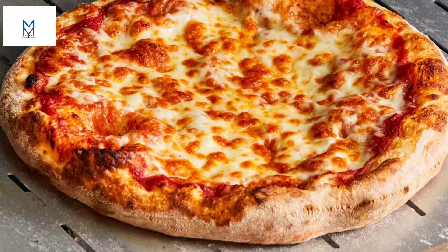Folding on a press brake is just like making a pizza — if you have all the ingredients sorted and all the properties set up correctly in your press brake, you are going to get a perfect fold every time. Choosing the right V is one of the most crucial elements in press brake folding. If you don't have the correct V or haven't calculated for it, it's going to be very difficult for the operator to get the right size fold.